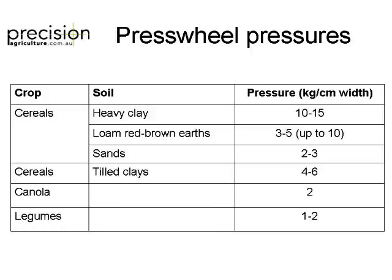I've actually run even more than 15 kilos one year in deep sowing sorghum. We're very chunky, come up very blocky, and we couldn't put enough pressure on it. Just simply could not wind up the spring hard enough to get seed soil contact. So it depends on the conditions at the time and what you're trying to do. But yeah, I think that's the trouble with some of those other lighter press wheels. They just can't get enough down pressure on them.